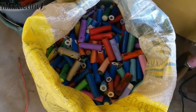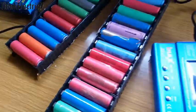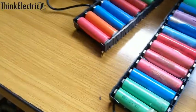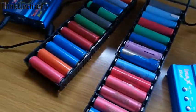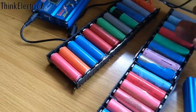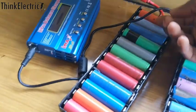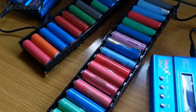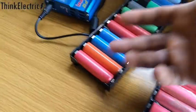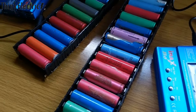All of these have been the work I've done so far — removing all the batteries from the Dell and Apple batteries you guys donated and the ones that I bought. I put them up here and then this one starts to charge — you can see how it's counting right there. If any cell gets out of range, I remove it, meaning those cells are already bad. I'm charging with very little current, a max of 500 milliamps, so I do not expect any of these cells to go hot.